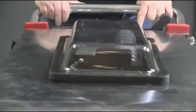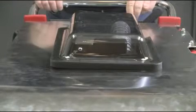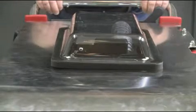Next, check the motion buttons as shown, located underneath the control column assembly. Make sure both buttons operate correctly and are free of wear and damage.